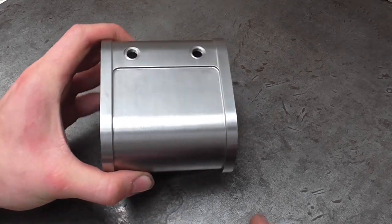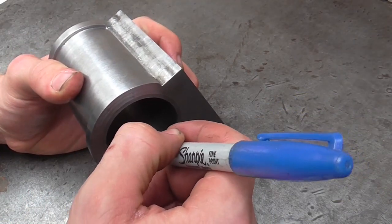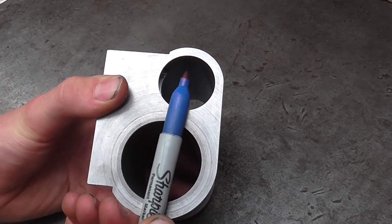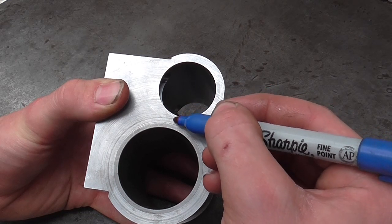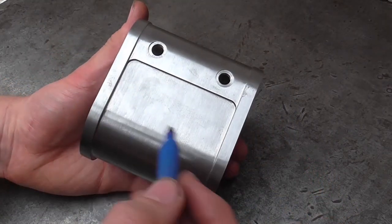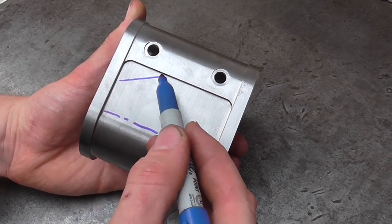In today's video I'm going to machine the passages that join the valve chamber and the main bore, and when I say passage it's going to be a slot that links the two together. I'm going to run at 12 degrees which intersects the two centre lines — so coming straight down here it'll be 12 degrees to that face, and looking from this view we take the centre line of the bore, it will be at 40 degrees going upwards.